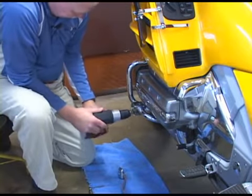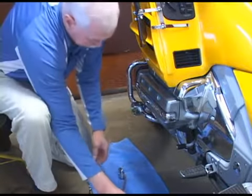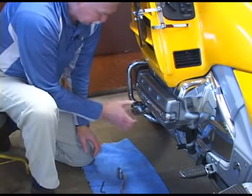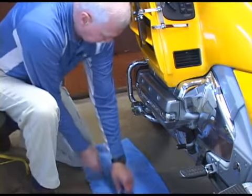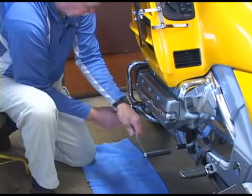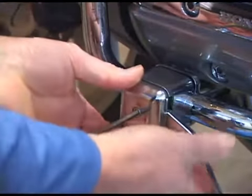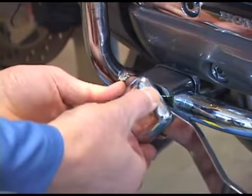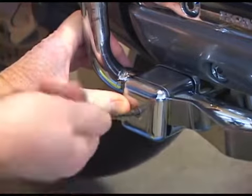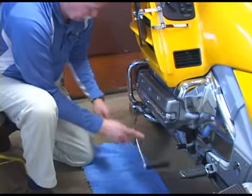We'll need to tighten the block. This doesn't have to be real tight on the Model DD — down this way it's trying to twist the block, not rotate it. I'm kind of pulling out on the leg to hold it against the cover. Get it down about finger tight, then back it off about a quarter of a turn. Pull the leg out again, then rotate the cover — that lifts the leg. When the leg's all the way up, the cover's almost square, so rotate it a little bit more, push in on it, and the roll pins will hold it in place. Then go ahead and tighten the center pivot bolt and you're all set.